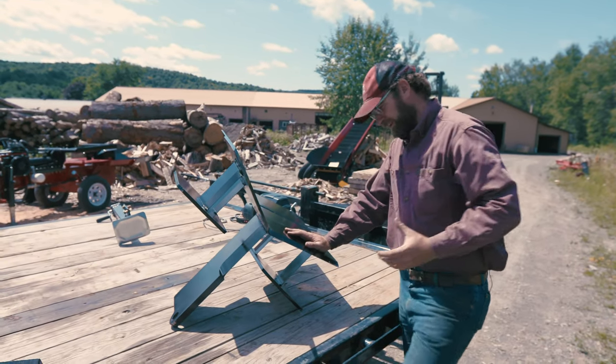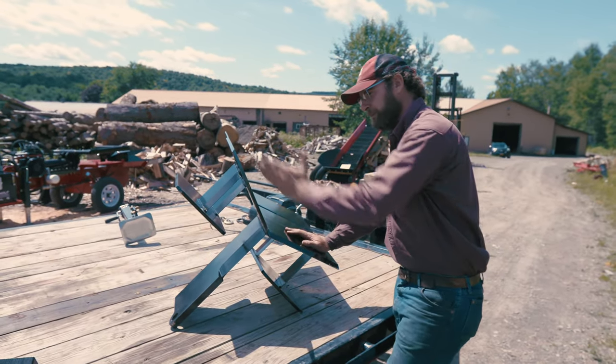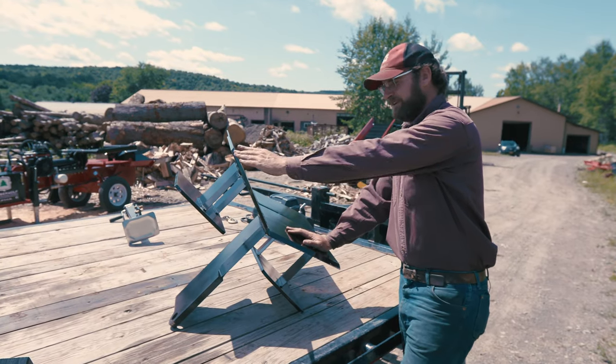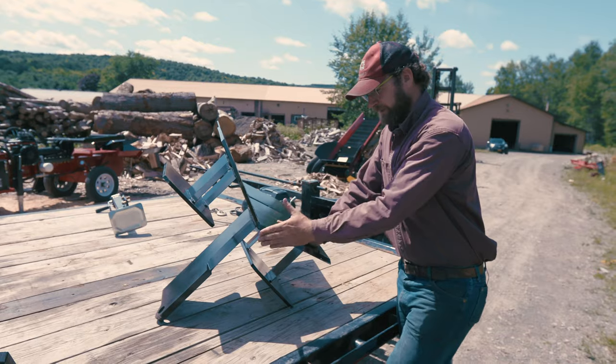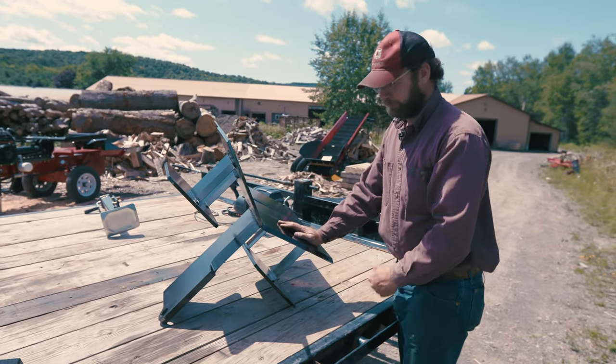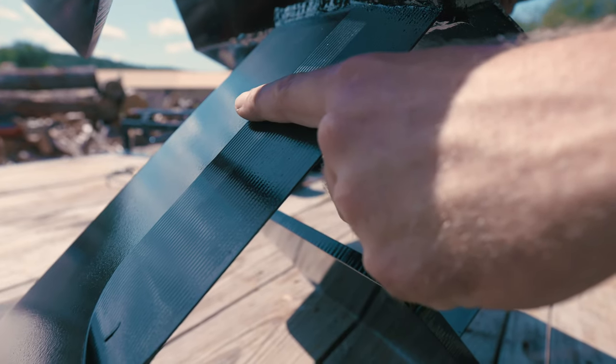It's attacking the wood in stages. So you have your first main horizontal split, and that's going to take the bottom 4.5 inch pieces of your block right here and cut that. It's going to travel 1 inch into that block before it hits our center split.